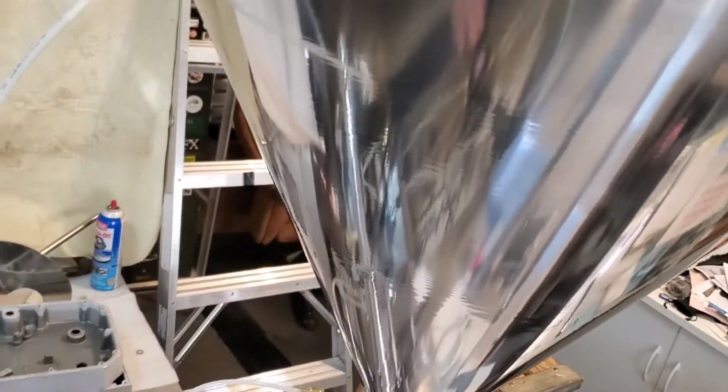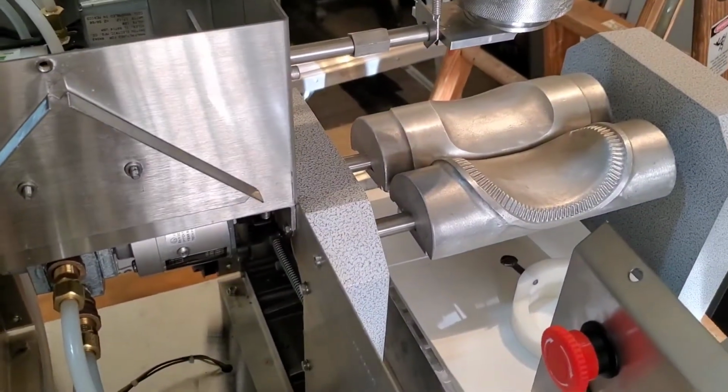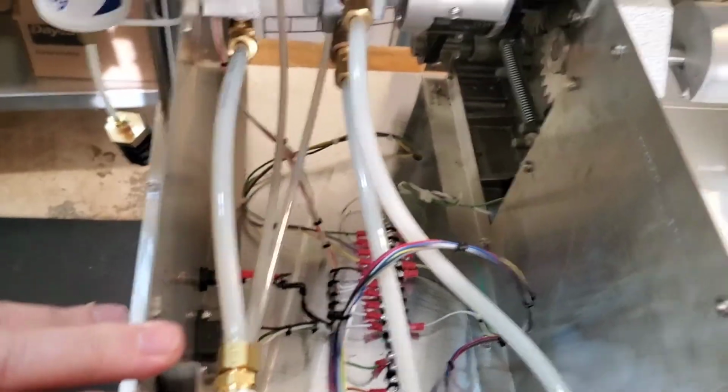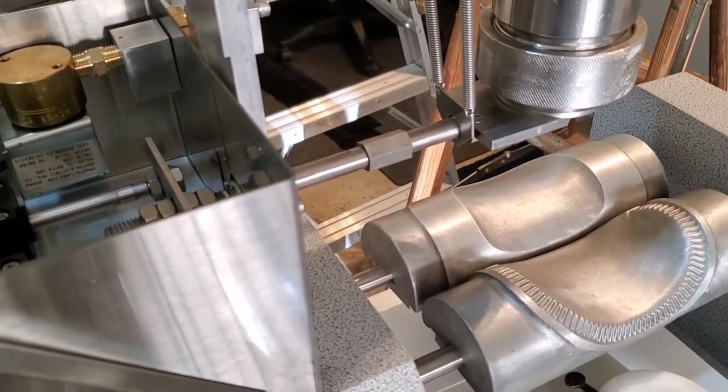The fill valve goes up to the hopper, to the transmission up here, that turns the auger that deposits the filling onto the molds, and then the knife opens and closes, regulating how much filling comes out onto the molds.